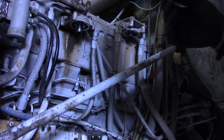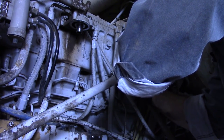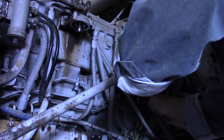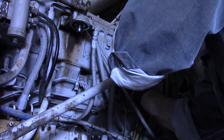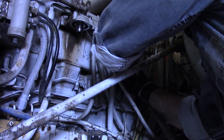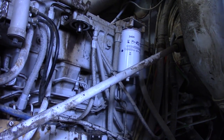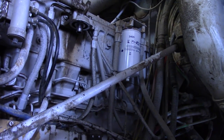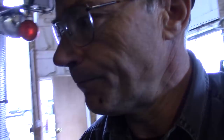Let's go ahead and spin this one on and then we'll do the other one exactly the same. We've already put our gasket on there. A lot of times to get it started you can turn it left and then right — that will get your threads going. Go ahead and spin that on. Remember, we're not going to put these on too tight. It's going to come up to the base and then we're just going to spin it on about three-quarters turn. That's going to be great — any harder and it's going to be tough down the road. When we do it again we'll probably be able to just take it off by hand or with just a slight use of the filter wrench. So we're going to do the same thing on this one: fill it up, spin it on. Then the next step is to start the truck up, let it run. And that's it — that's all the fuel filter changes. Simple.